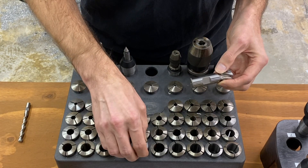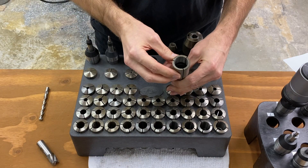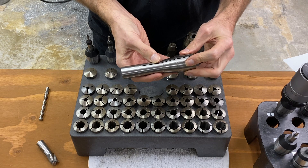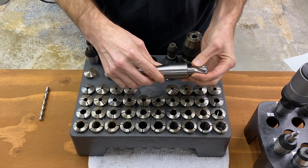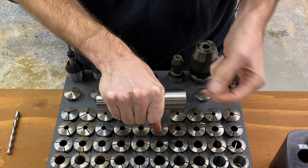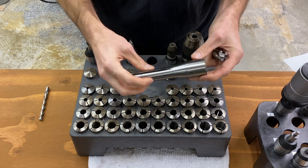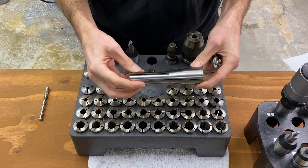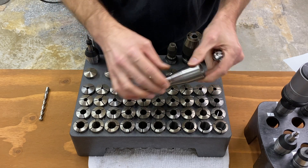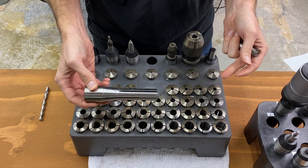Another thing to mention about R8 is that the maximum size you can hold is usually about seven-eighths. They do make a one-inch collet in R8, but as you can see, this one sticks out another inch and a half. Because it's still a spring collet, there's nothing supporting the tool out there — your spindle is clamping partway up and there's nothing else supporting the tool beyond that, so it can still flex. I wouldn't trust this for anything requiring a lot of rigidity. This particular tool is kind of a gimmick — not super useful. But if you needed to do some light milling in a pinch with a big one-inch cutter, you could probably get away with it. We have one because it's been handy a few times.